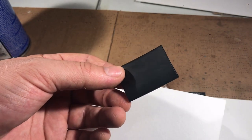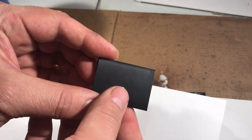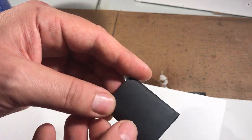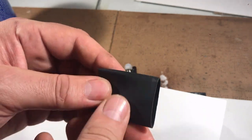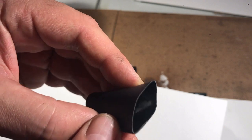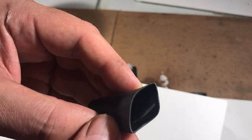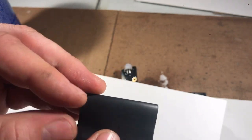While the back of the motion detector is drying, we're taking this strip of dual wall adhesive lined heat shrink. You want to cut a size that can cover the sensor down and cover a little bit of the wires. What's really cool about this dual wall heat shrink is it's very robust, and that glisten on the inside is an adhesive line glue that's going to melt around the board when we apply heat, further sealing out any moisture. We use the same material in ruggedizing moisture sensors.